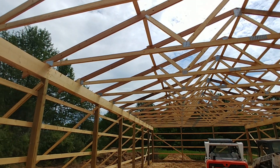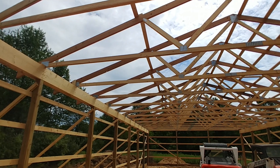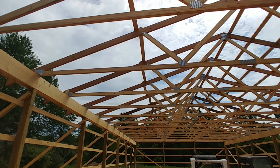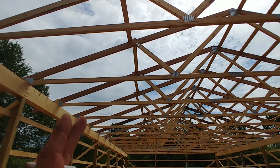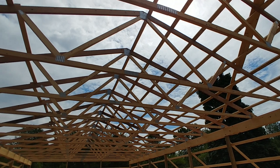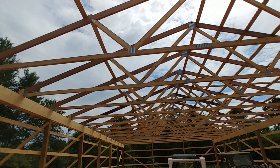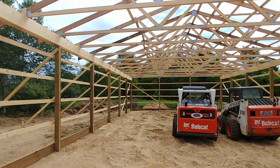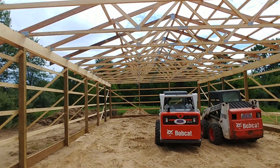When the contractor comes back on Monday, you should see the rest of the purlins — the boards that go this way up on the roof, as you can already see them over here. They're doing that because that is how the steel roofing is going to go on this structure, as the entire building is going to have a steel exterior.